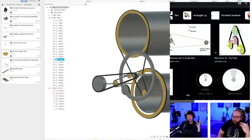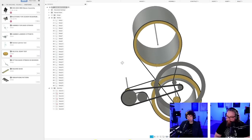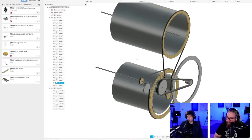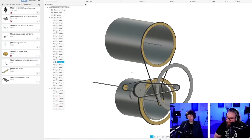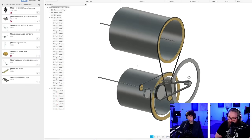And then, if there is a tensioner, yeah. I'm getting a little worried that all these belts and tensioners and reversals will consume a lot of energy. Actually crossing the belt could perhaps be an option. You just have to keep it... A bit fiddly, just drive the drum from a different shaft. You can make the ratio whatever you want.